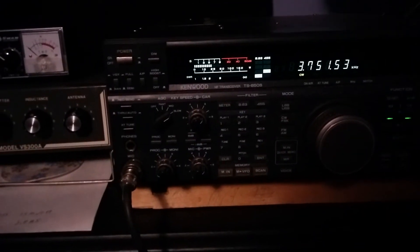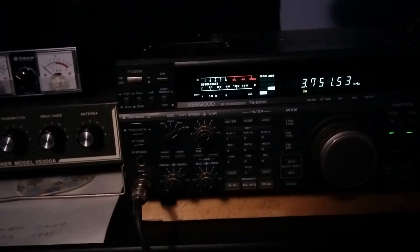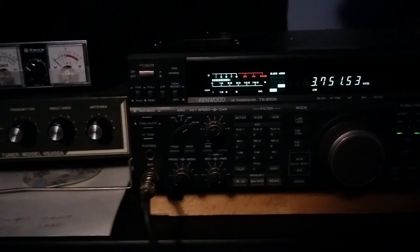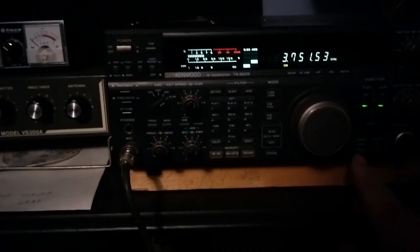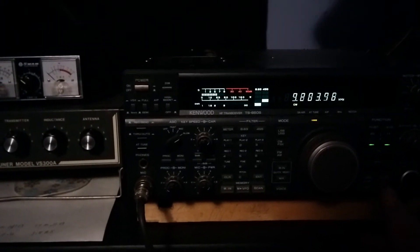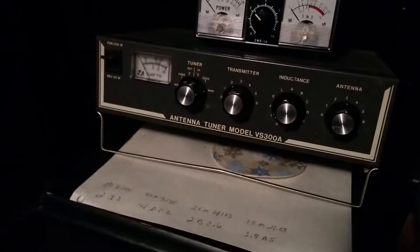This is just an indication of relative SWR, not necessarily an accurate measurement, but it gives you an indication at least. On 80 meters with an 80-meter dipole in an inverted-V configuration it's going to be around 50 ohms, so with 300 ohm twin lead you're probably looking at a 5-to-6 to 1 SWR. That's not extremely high, especially for balanced line — for coax that would be a killer for performance, but not for balanced line.